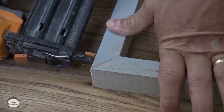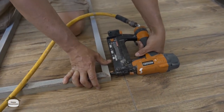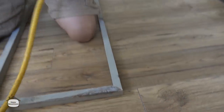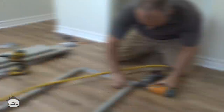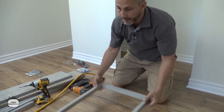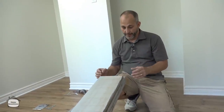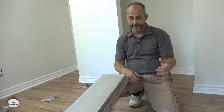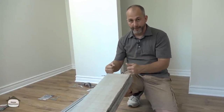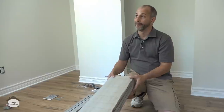We're going to fire in a couple of brads to get everything nice and tight. Because all this is rustic I'm not as concerned with how we line it up as much as making sure the back is flush. Now with rustic lumber we do not want to trust that end cuts are square. We're building a door so all joints have to be perfectly square - make sure you have your table saw locked in position and pre-cut all ends at perfect 90s.